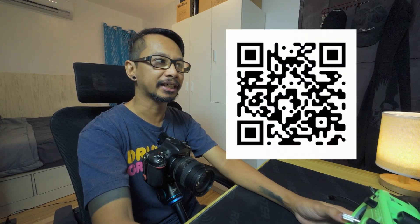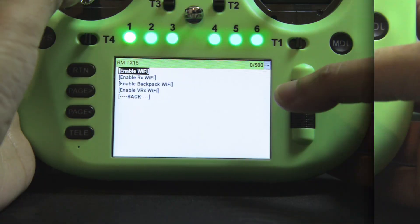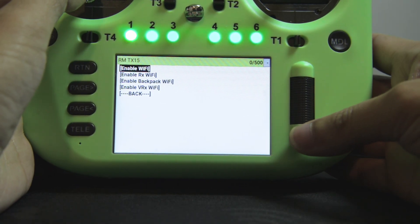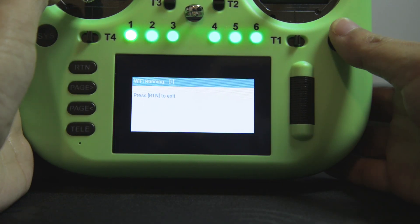On your screen now is the QR code to the updating guide on the ExpressLRS website. If I updated the ExpressLRS firmware on the internal module, then I can set a binding phrase via the ExpressLRS configurator. But since we didn't do that, I'll have to set up the binding phrase from within the ExpressLRS web UI. To do that, I have to enable Wi-Fi mode on the internal module using the Lua script, and then connect to the access point.